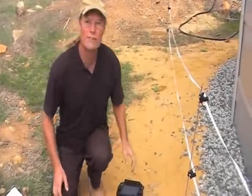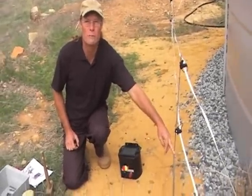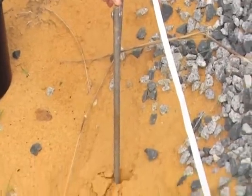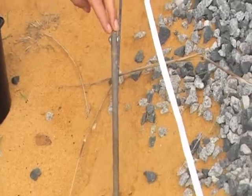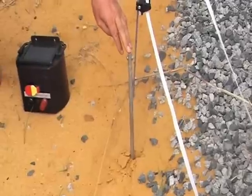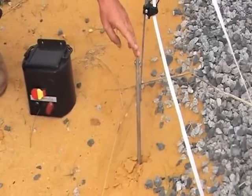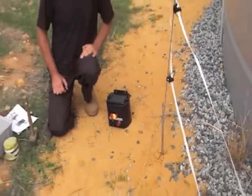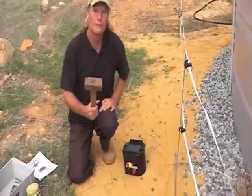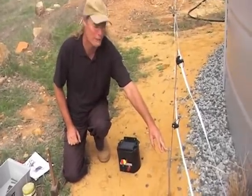There are only a couple of basic things you need to know. The most important thing in the whole electric fence industry is the earthing peg. We use a 10 or 12 millimeter galvanized steel rod — it can be a steel reinforcing rod or a plain rod, but it needs to be 3/8 of an inch or larger, or 10 to 12 millimeter. The length needs to be one meter or more, probably one to one and a quarter meters long. Hammer it deep into the ground with a decent hammer. I've got a hole drilled in the top of my piece of steel here and I've got a bolt there.